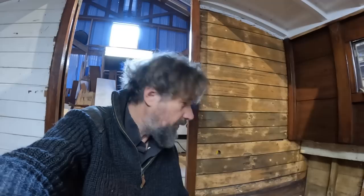Good morning. Well, time to start paneling these walls. Now this one's actually against an exterior bulkhead, so I'll test fit the panel I put in and remove it, and I will varnish the back side of that because of the possibility of humidity coming through here.